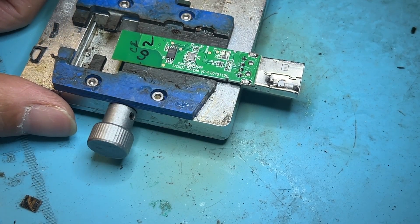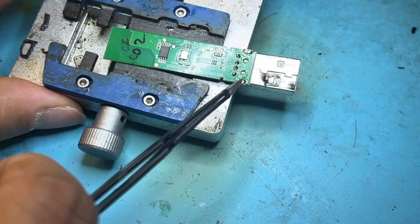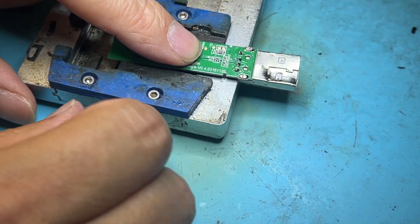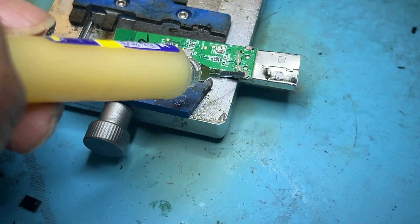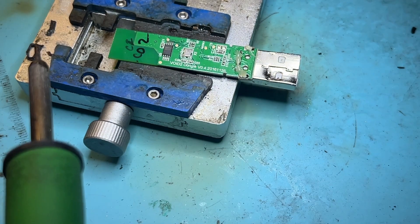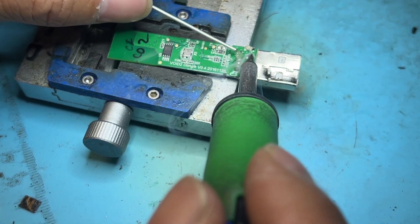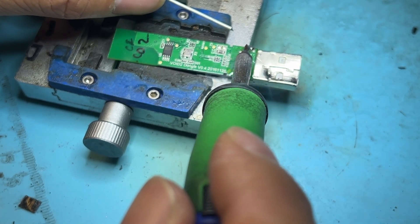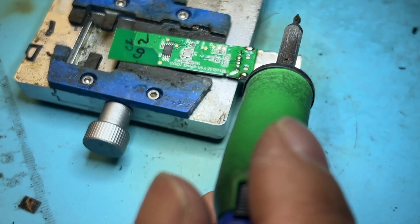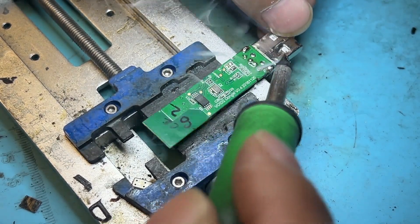We have this broken port on our workbench and we need to remove that. A lot of times people will just use heat to melt the solder and get the thing off, but a lot of times heat can damage the board and you just don't want that to happen. So what I do is I use a low melt solder to loosen the port — it's pretty easy enough to just pull it off. The low melt solder melts at around 130 to 140 degrees and takes time to get hardened. What I'm doing right now is applying the low melt solder and just giving a little gentle heat over it.